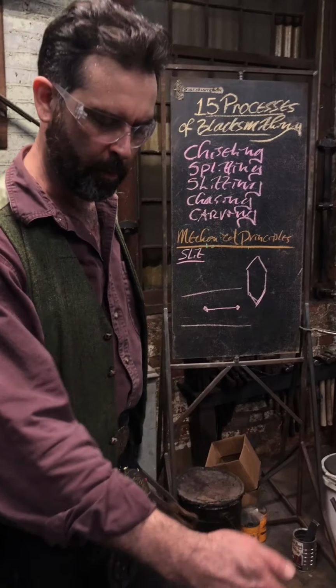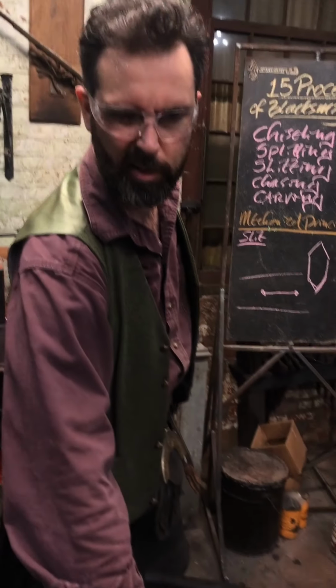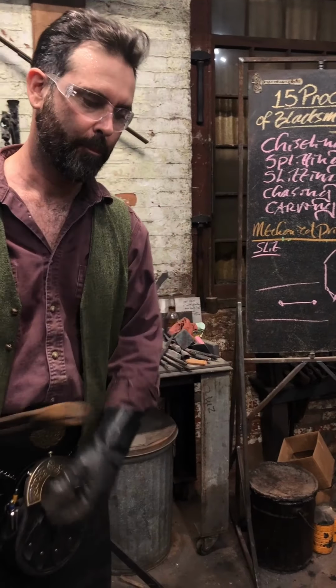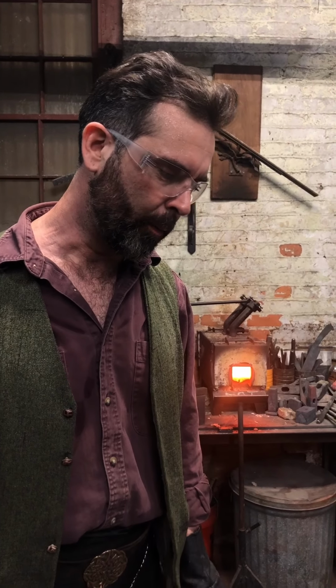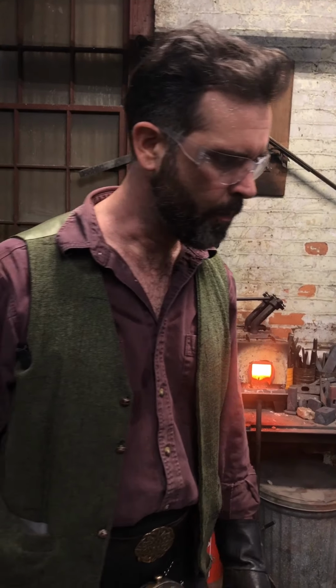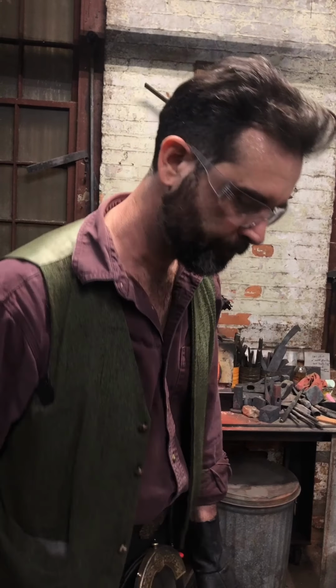I was going to talk about dropping in the tool this way and hammering down on it, but it's not going to lock in well to any of the devices. But you get the basic idea of it. You've got to work through from both sides. It kind of incises out in the middle-ish. You do get a little bit of push. If you use a sharper tool, it will cut less and produce less rag, but at the same time, you're also going to probably blow out the temper a lot faster. So, things to think about.